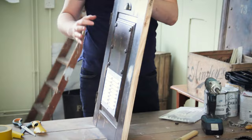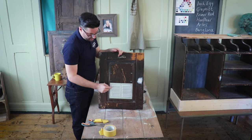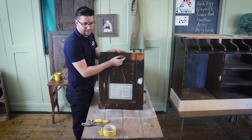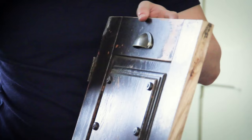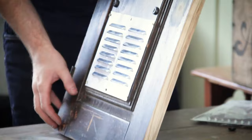Now we have to do something very interesting. I don't normally use spray paints — they're not my favourite for the VOCs and I don't like to breathe in those fumes — but we're going to have to apply some spray paint. The reason being, I do not want the metallic to show through. I sometimes do this with hardware I'm painting over — if I've got a chrome finish and I want to make it vanish, I'll just give it a light misting of spray paint, a brown or a black. So we're going to take this outside the workshop to do this.